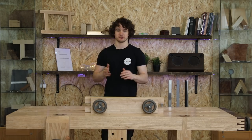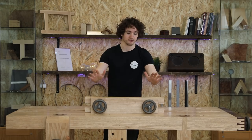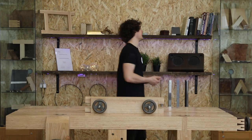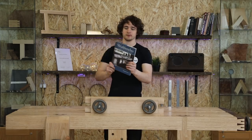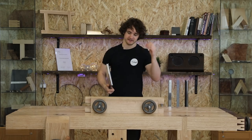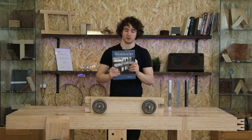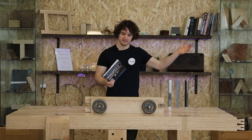For the leg vice on an existing bench, you just need to make sure you pack out the leg so it's flush with the top of the workbench. And if you can't do any of that, look into the Moxon Vice — especially if you're a box maker, something like this is going to be really good for dovetailing, though you still have those limitations I showed you. If you want to know more about building workbenches, the book by Chris Schwarz — Workbenches: From Design and Theory to Construction and Use — is what I used to design this entire workbench and dictated my choice of leg vice and wagon vice. There's so much information in such a thin book. I'll put a link in the description — if you buy through the link I'll get a small cut.